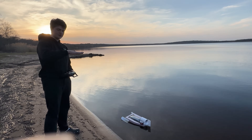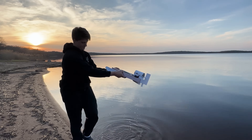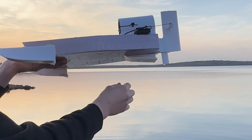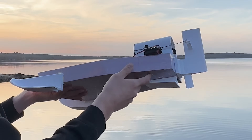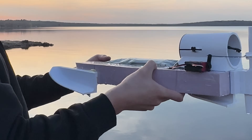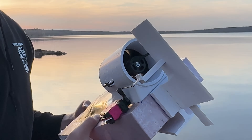I'm thinking that the reason why it started to kind of crab walk to the side was because of the fins on the front skimmers. I'm guessing that somehow this brings the center of pressure, once it's up on the hydroplanes, farther forwards than the center of gravity. So what happens is it kind of skews a little bit, and then eventually this thing has enough correcting moment to right itself back on course, but not until it's like sideways. A way to fix that would be either to remove these fins or make the rudder deeper. I'm not going to do either of those right now, so I'm just going to drive it around a little bit more and fix it another time.